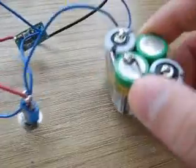What I've got here is a digital multimeter. The first thing we have to do before performing any measurement is to identify the maximum rating of the instrument we're using. In this case, we can see that this meter supports a current measurement of up to 200 milliamps maximum. Therefore, we shouldn't use it to measure current greater than 200mA for fear of damaging the meter.